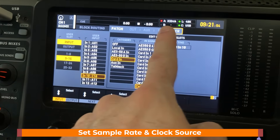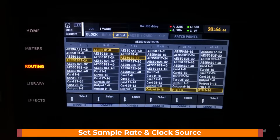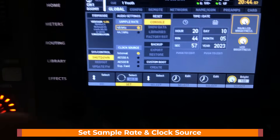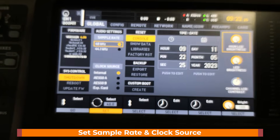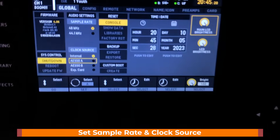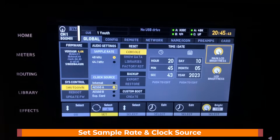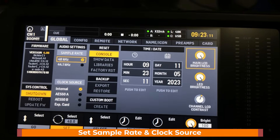One thing I'm noticing as we set up the routing is the A with a little red mark in the box — that's the AES50. That means there's an issue connecting these two devices. If I go to setup, these are probably my issues: it's set to 48k and set to internal as the clock source. Let's check the other console — also 48k and set to internal. There's the problem: they can't both be set to internal, and you'll notice no audio passes between them. Let's make the front of house console the primary clock, then on the rack we'll set it to AES50A instead of internal. Now it all blinks, and a couple of seconds later it comes back on. Audio should now pass through.